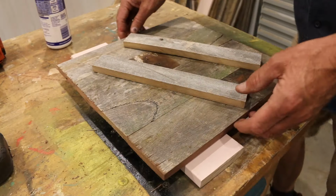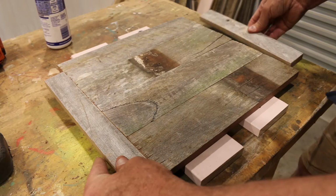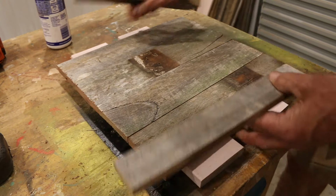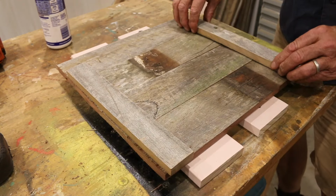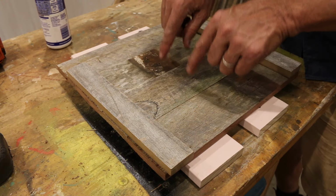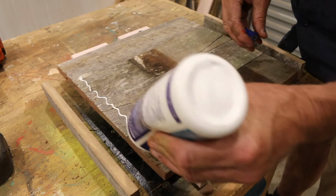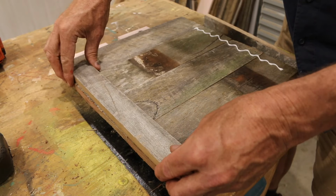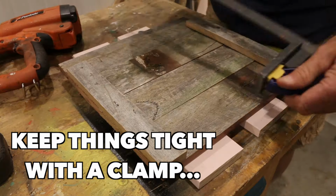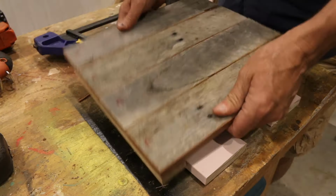Okay, the first step in the assembly process is that we need to nail these end panels together. So just get the edges nice and straight, nice and tight, and then we'll simply nail these 2 pieces on like that. And this is the inside of the planter box. A bit of glue never goes astray. And then just simply nail these on. Beautiful.